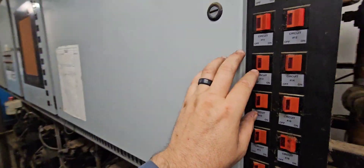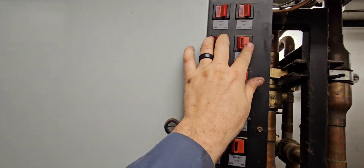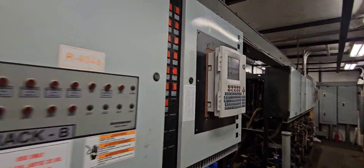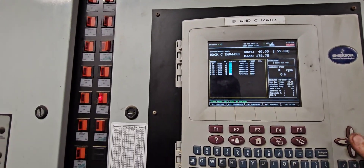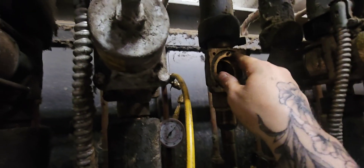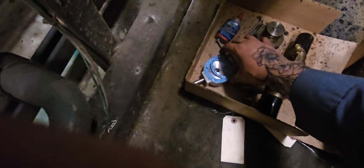While he's doing that, I'm going to come back over here and turn all these circuits back on. Something else you don't want to forget is taking these compressors out of manual override. We've got this old valve body out — just need to get all this cleaned up, make sure we get all this old gasket off and that surface cleaned up. We've already got all these new gaskets lubricated up, so once we get that cleaned off we'll be ready to put the new one in.